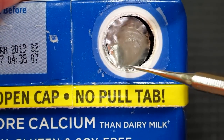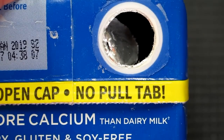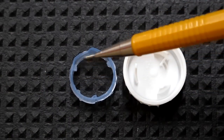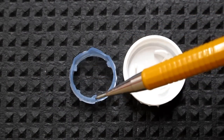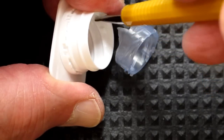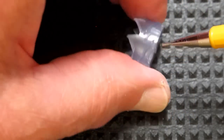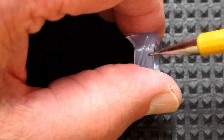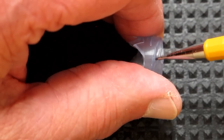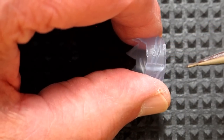As that cutter section is lowered it turns and cuts this foil and pushes it down. The three fingers of the cap engage with these three raised sections or dogs inside the cutter. The left-handed threads inside the neck engage with these double left-handed threads that are on the cutter. The white thread on the neck runs right in the center of this double blue thread, so this is very well guided as it is extended.